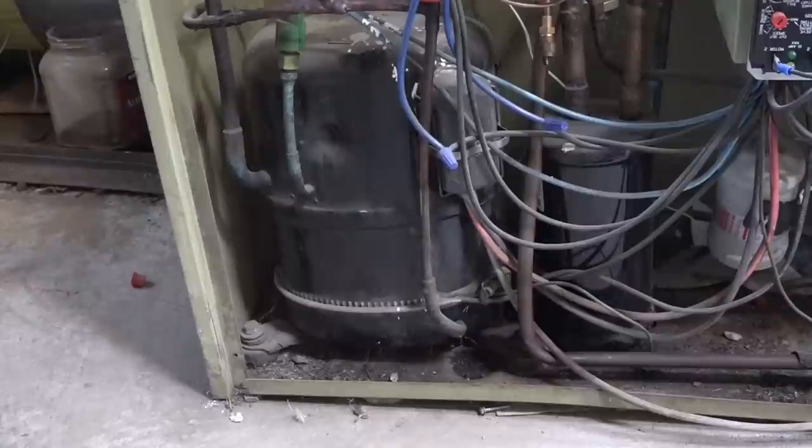So the number of things that can happen are: number one, you lose lubrication because you thinned out the oil; number two, you can slug the compressor and cause damage. That's why we put these heaters on — just to keep it warm.